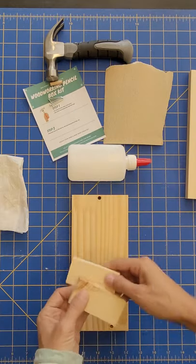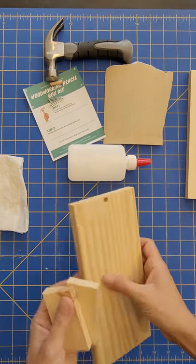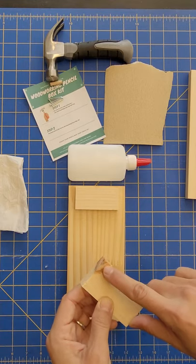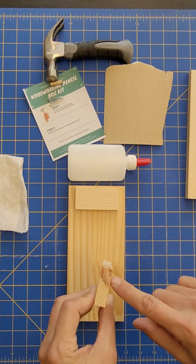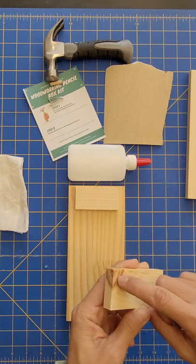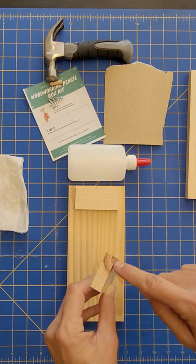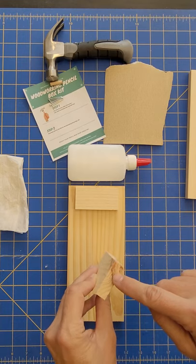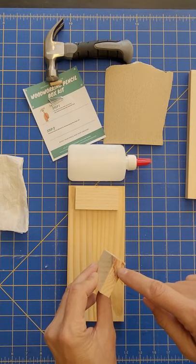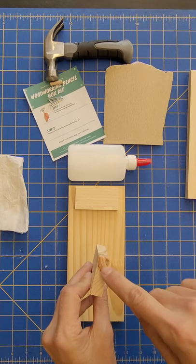You won't even see those, and for this piece on the bottom I just turn it over or I could put it on the inside of my box — it's your choice if you have a piece of wood like this. Also keep in mind if you have a knot, we try to make sure you're not nailing into knots. The knot is the hardest part of the wood; trying to nail into it means your nail will just keep bending. So just come down a little bit lower and put your nail there instead of right into the knot.